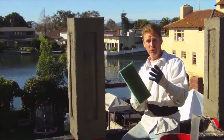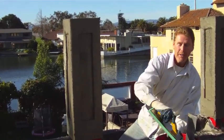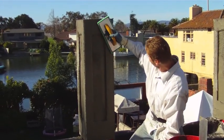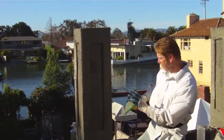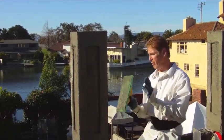I'm using a brand new sponge float because I don't want the edges all torn up. I'll go through two or three of these. I add water — and all I'm going to do is bring the aggregate out. This is called floating. So I'm going to float this whole piece right here.